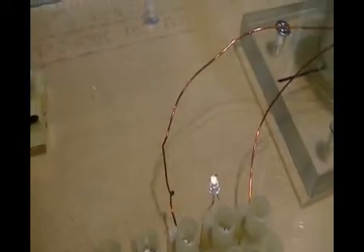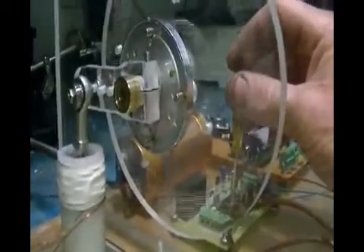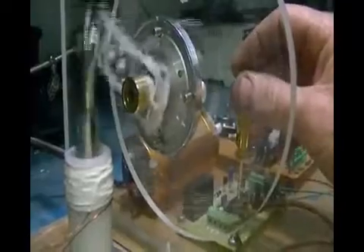We are using very, very little power at the moment, and we're definitely getting back EMF as well. The more load we require from the motor, it's just a matter of pulsing the piston a few more times to speed it up. The flywheel will remain at pretty much the same speed when it's not under load. So there you have it, Russ — this will be your little popper unit hooked up to my engine design, giving maximum thrust through the crankshaft and turning all that cylinder power into rotational force.